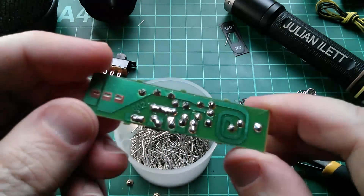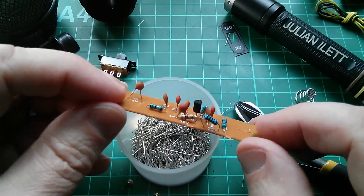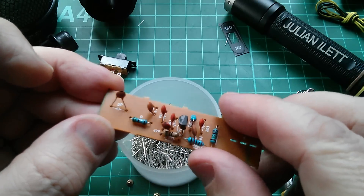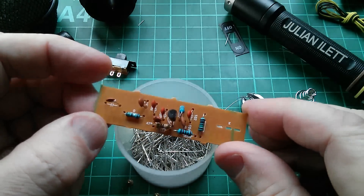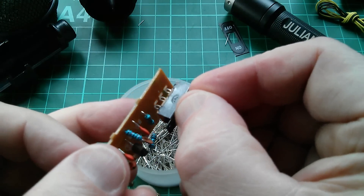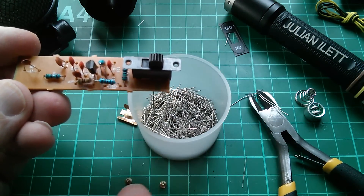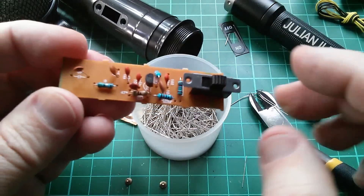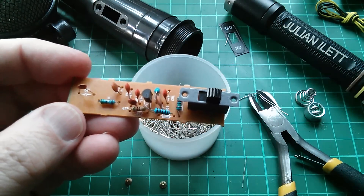Done. Okay that's the underside — what's the top side look like? Oh, not bad, although some components fell out and some of the resistors didn't fit properly, so I just lifted them up. I've done this factory style and haven't really taken much care, but that's okay. Now I need to solder in the switch, which solders onto the board and screws down with two little screws onto the microphone body, holding the board suspended inside.